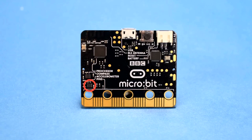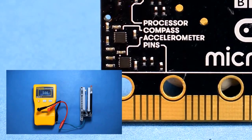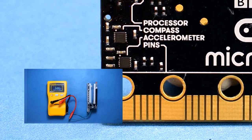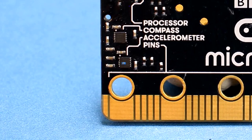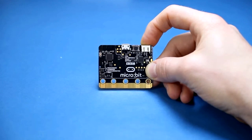I can't really swing all these parts around, but I hope this gives you an idea of how we can measure acceleration using electronics. And, of course, with all things electronics, humans have managed to figure out how to make this whole measurement setup very small, like really, really small. This tiny chip on the back of the Microbit is an accelerometer. It packs microscopic versions of the lever arms and a way to measure capacitance, just like in our larger demo. In fact, it can measure acceleration in all 3 dimensions.